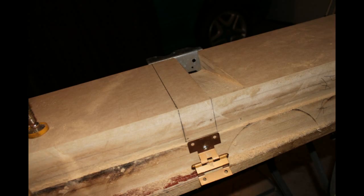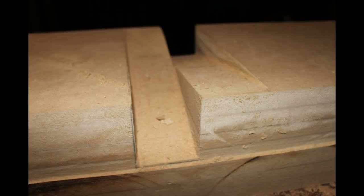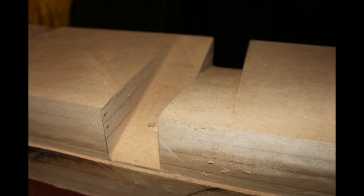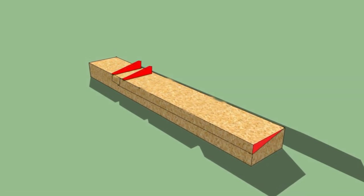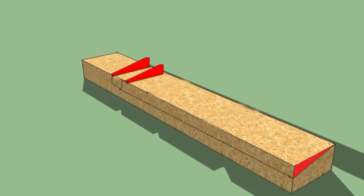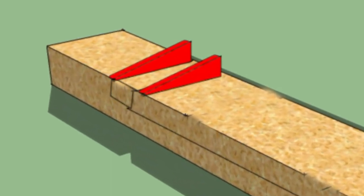Once you've done that, I went on and did the second hole in reverse. Somebody has been saying that you can use a power tool to do this. Yes — you can come back to the end of the dummy, the half dummy that you glued together, trace the whole triangle out. This is the triangle at the same angle as the angle hole that you're cutting. Trace two pieces of it out, cut that out of another piece of wood, and practically screw it onto your dummy. Because you're working on the inside half of the dummy, you can easily screw it down and then cut over that using it as a jig with a circular saw if you don't want to cut by hand.